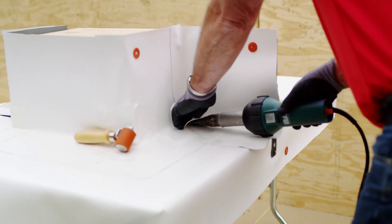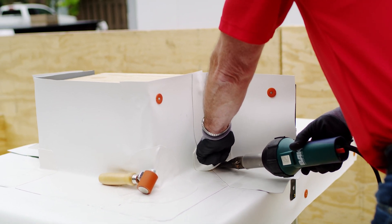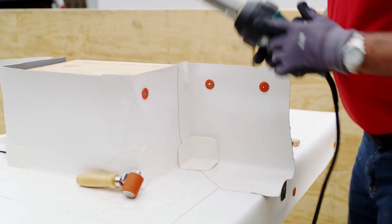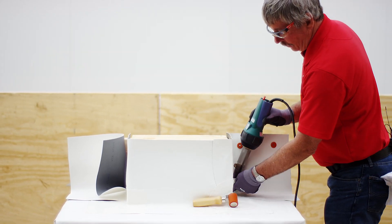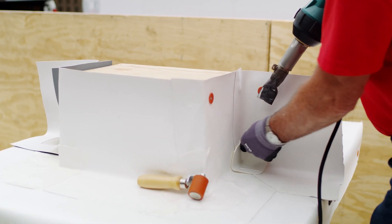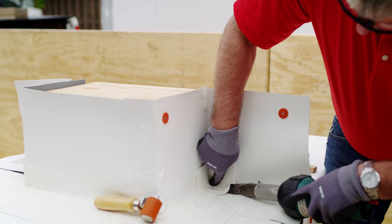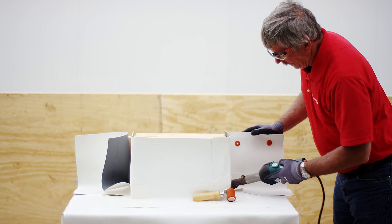I'm going to stick my gun back in here as far as I can and do this right inside corner. I'm going to work this angle change out. Now I'm going to come up this spine right here because it's kind of wanting to walk away from the corner. If I were to do this right now I'd have to really overstretch it, so I want to come up and do this very inside corner right here. I like to lay a little heat on the outside just to soften this material up, make it a little more pliable so I can stretch it more easily. I'm going to go down here again, come all the way back to this corner, make sure my angle changes are nice and tight, and do the same thing over here.